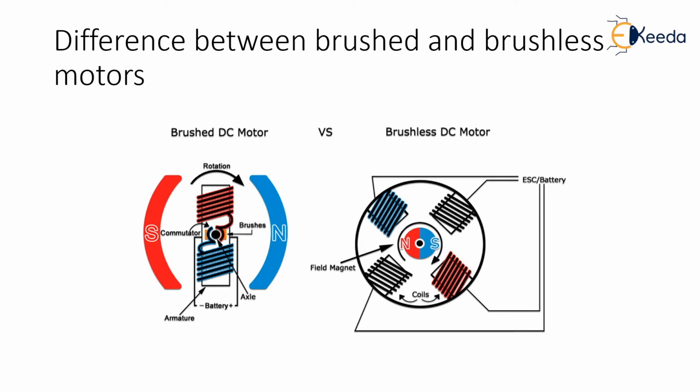The size of a brushless motor is identified by a 4-digit code that details the dimensions of the stator in millimeters. For example, 2206. The first two numbers in the series determine the diameter of the stator, in this case 22 mm. The final two describe the height of the stator. The last two numbers in this series are 06. Therefore, the stator unit is 6 mm tall. It is important to remember that these numbers do not describe the external dimensions of the brushless motor itself.